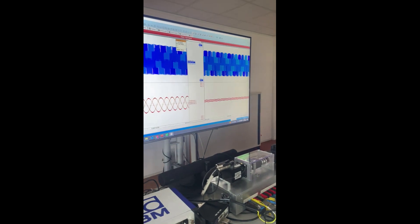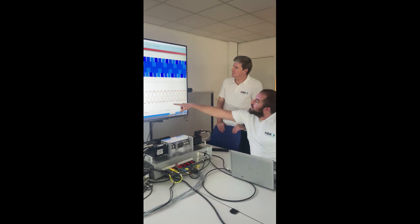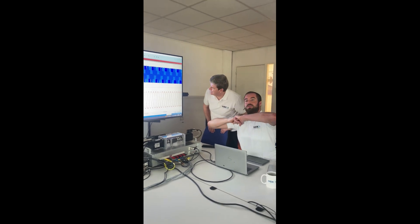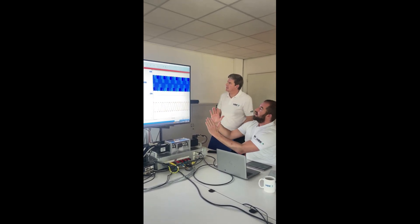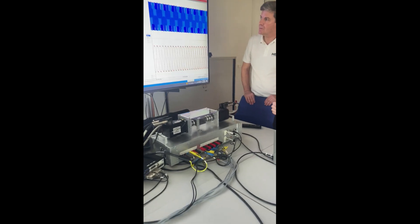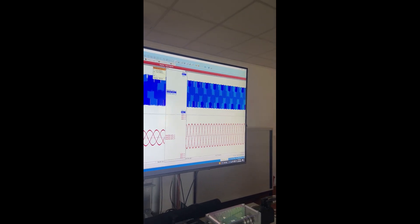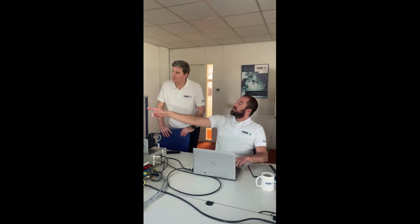So how do we show torque on that? Well, this is efficiency mapping. We've got the voltages up here and the currents down here, and you can see the amplitude on the current changes when the torque increases, so we get more torsional force. Then we change the speed, and we can see the distance between the peaks get shorter, because the higher the frequency, the higher the speed. Back to low torque, higher torque, higher torque — and the rig is sending a trigger to the acquisition unit where we're recording all this data, and every time we trigger, we're populating the efficiency map.